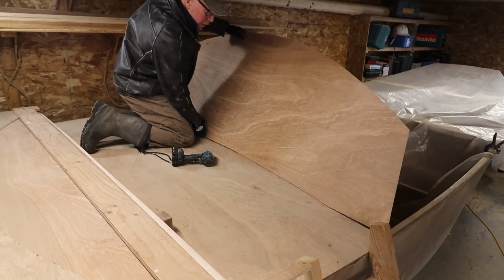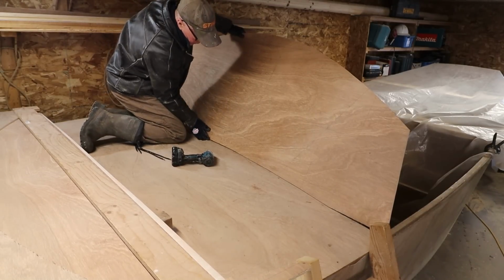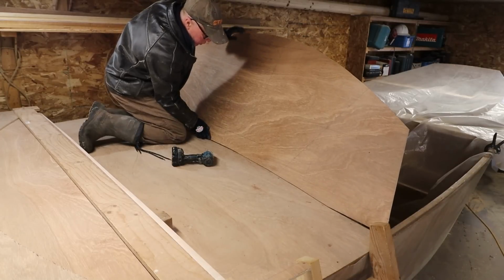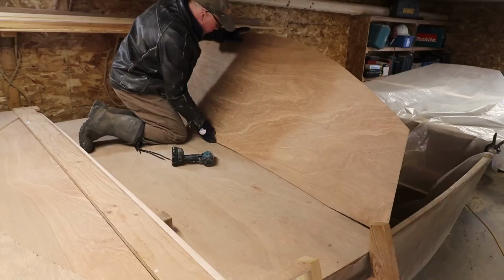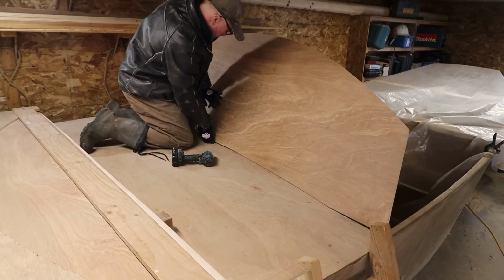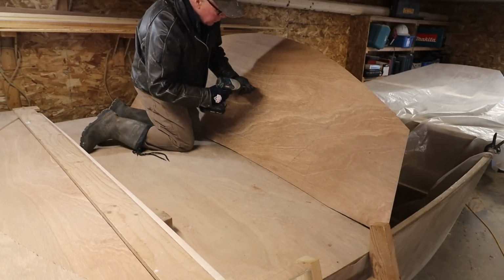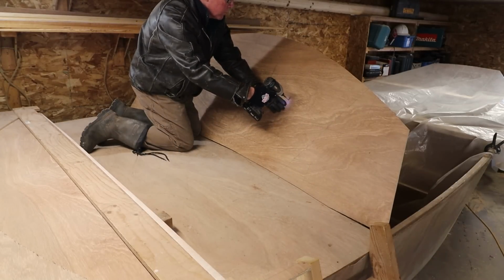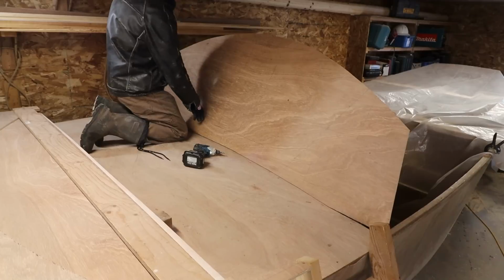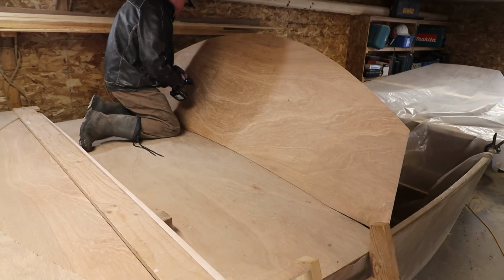So the trick with so much carpentry is to have center lines established, and then you can line up your center lines, and once you've done that, then you don't need to be at both ends checking. You can always come back and do that a bit later, but this gets us started. Okay. So now we're going to get a screw into those temporary supports. These holes will have to be filled at a later date.